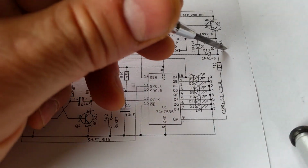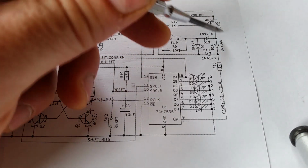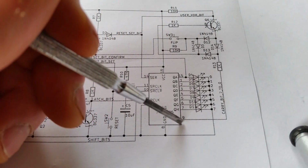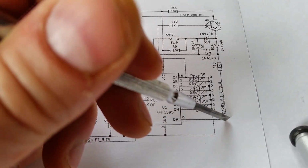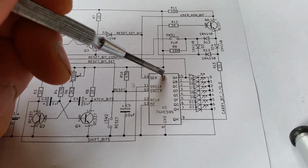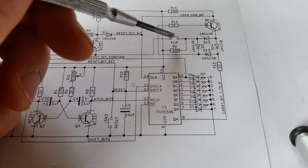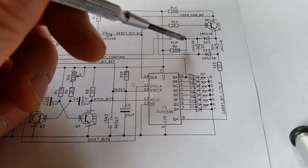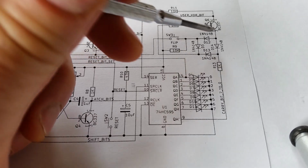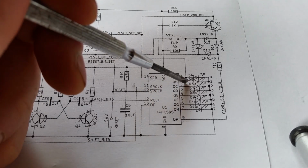So these 4 diodes make up an exclusive OR gate, and then this NPN transistor inverts the signal from the exclusive OR gate. And so if I talk in terms of LEDs coming around here and getting down to this point, if it's extinguished it'll be a 0, if it's lit it'll be a 1. And this is the user button. By default it's pulled up to 3.3 volts, so by default it's high, and if someone's pressing the button it'll be a 0. So first of all, no one's pressing the button, there's no LED here, so 0 and a 1, exclusive OR is a 1, which gets inverted to 0, so the extinguished LED gets wrapped around.